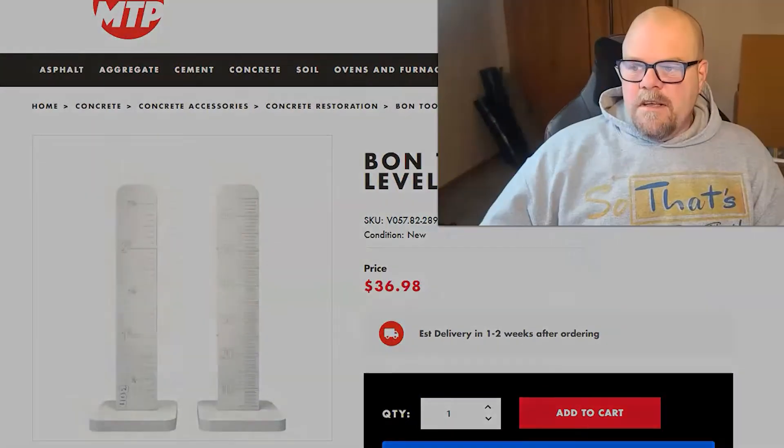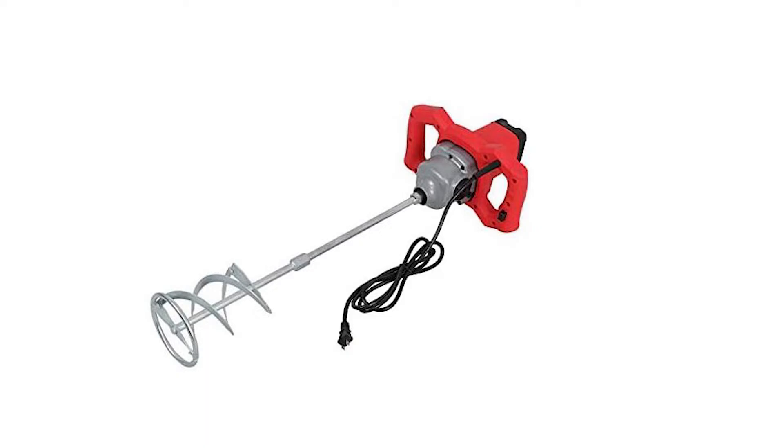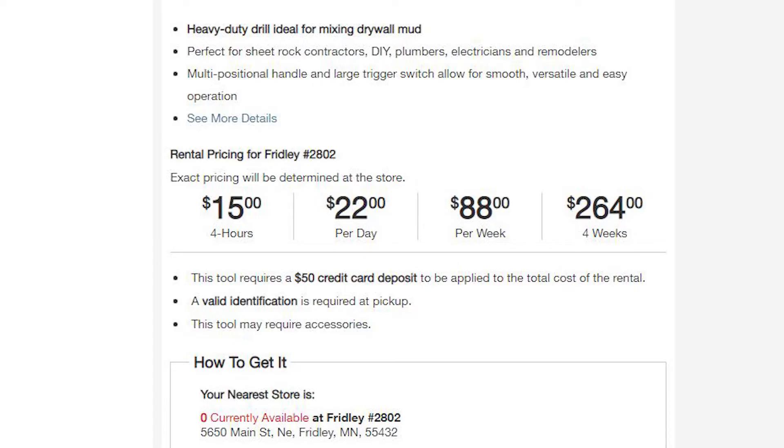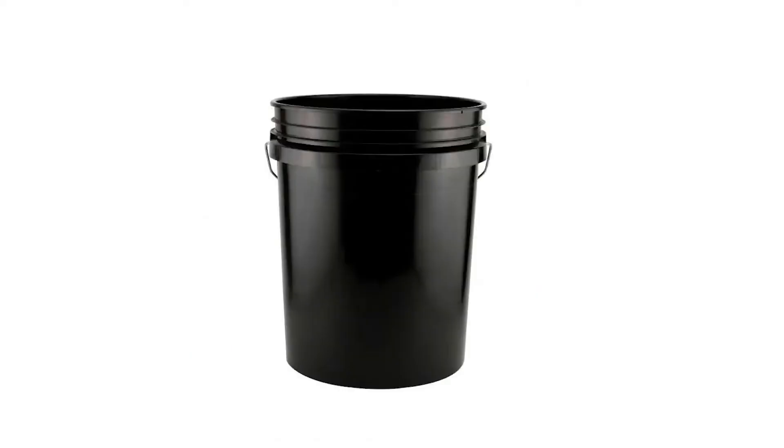While you're doing this, you want to make sure you have a good mixing drill. If you don't, rent one — a heavy-duty mixing drill that's not going to go out on you during the process and has some power. You can rent one from the hardware store. Also make sure you have lots of buckets; I'd buy eight. You want a lot of water on hand and buckets to pour from. For example, on a leveling job I like to have three people: me pouring and smoothing, a runner going back and forth with buckets, and another person mixing.